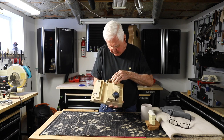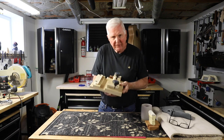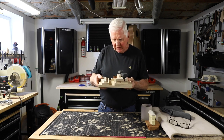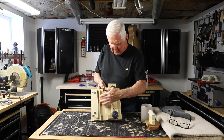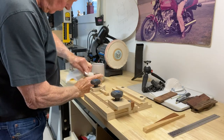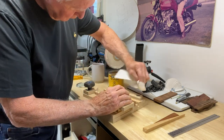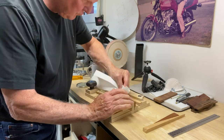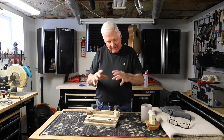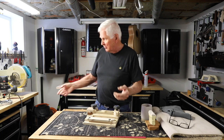These are my stops at either end, and my stop up here and then down here. For some reason this piece of wood tended to be just a tad lower, so I put some tongue depressors on here and glued them in place. I got some Minwax and I use the Minwax on the top here, on the top of this, on the side here and on the side here. That's to allow the plunge router to fit in nice and snug and slide nice and smooth as it goes across.